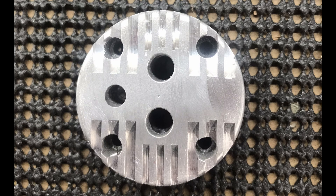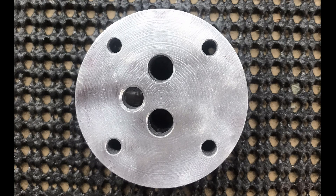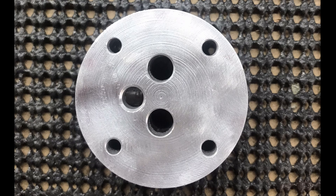Here's the cylinder head after we cut the fins into it, and this is for the valve guides. The bottom side of the cylinder head shows the hole where the spark plug comes in from the left, and the other two holes are the valves and valve guides. We have already cut the seats into the head using the tool. You can also see the threaded section where the spark plug comes into the combustion chamber.